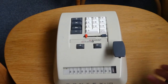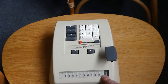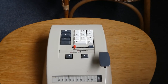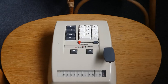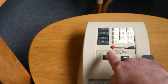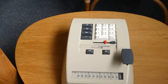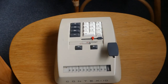So far the result of my division is 25. And because it's all zeros now, I'm done. So when you divide 625 by 25, you get 25. To get rid of the division button you have to clear the input again, and it pops up. So this was the Contex-10. Thank you for watching.